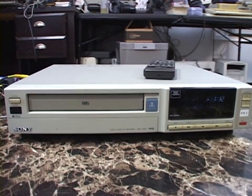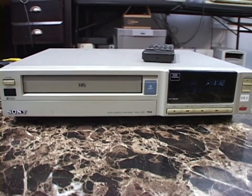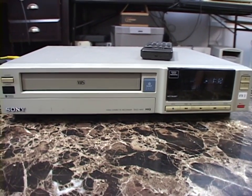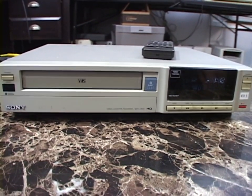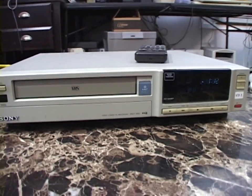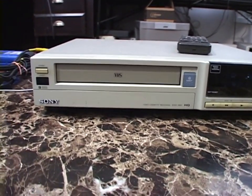When I first got this it worked fine with no electronic issues, and I used it for a while. Then I put it away for a few months, and when I dug it out recently it wouldn't even power on — no sign of life when plugged in. It turned out that while sitting in the closet, all the power supply capacitors had just rotted; some of them leaked their guts out. I had to remove the power supply and replace the capacitors to make it function again.